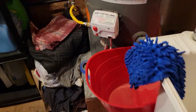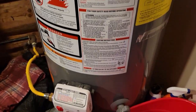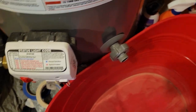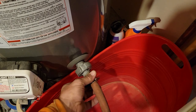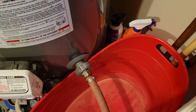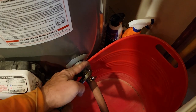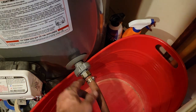So here's the water heater — it's only a few years old, and I'm pretty sure it's 40 gallons. You're supposed to rinse these out on occasion for any corrosion or whatever. At the very bottom is a drain, and it's got hose threads on there. I'm going to hook up my hose to the bottom of the water heater. I've got a bucket there to catch any drips. You don't want to over-tighten it because this one's plastic — some have brass fittings and you can go a little tighter — but just make it nice and snug so that rubber seal seals.